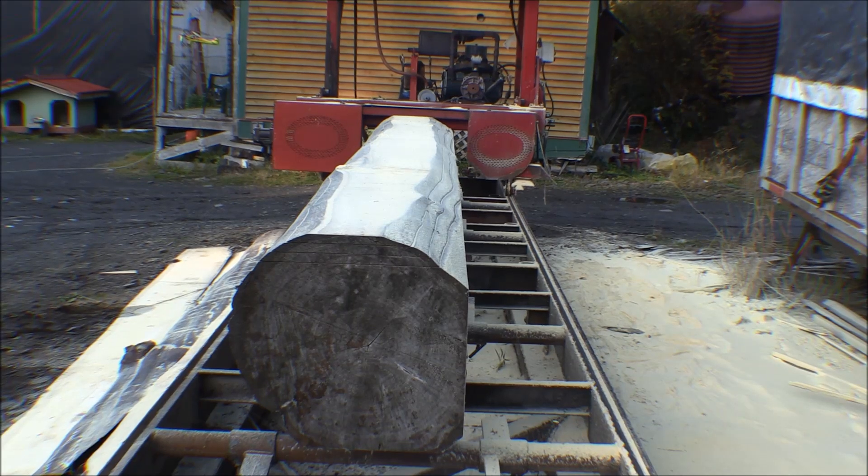I think I'm done for today. So far I've got five one-inch flitches off of it that can be cut into one-inch boards. I've got eighteen and a half inches between those two flats. I can roll that log over and take a slab off the third side and that'll give me a cant. Then I can rip that down into the widths I need - I want to make some six-by-sixes, some four-by-sixes, and some more two-by-sixes, so everything's going to be a six-inch dimension. I can rip up some six-inch cants and cut my finish timbers out of that.